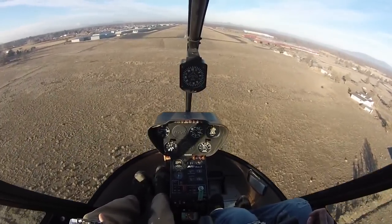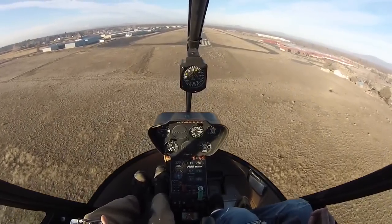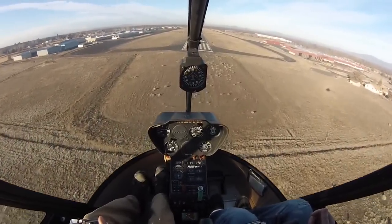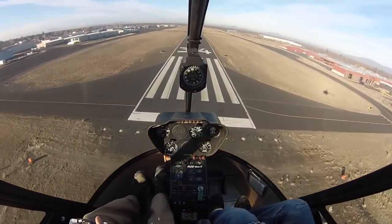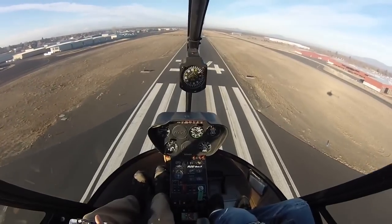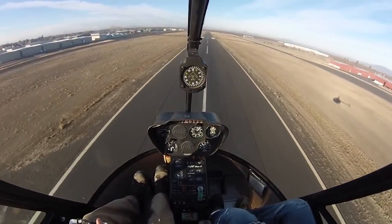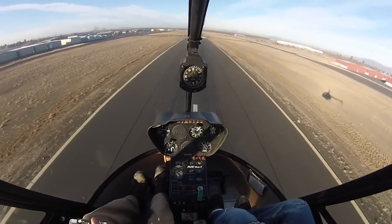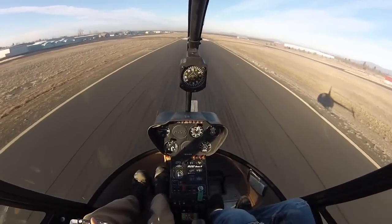Make sure we ID the windsock — windsock's showing still out of the north. We're about 50 knots, so we want to ease back on the cyclic a little bit. Back, coming over the threshold, feels a bit like an air taxi. Keep on coming down. Bleeding off airspeed now. Here's our 30 knots — at this point we're going to have to start pulling up on power if we want to stop ourselves from sinking.